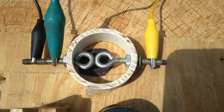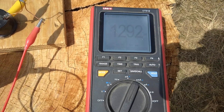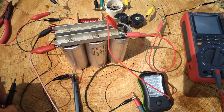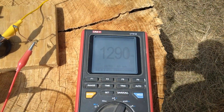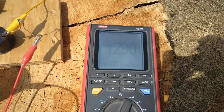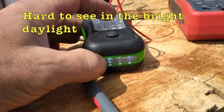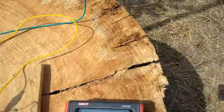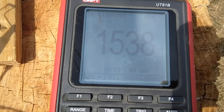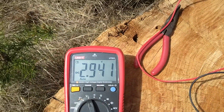It is sparking — I can hear it. We are getting about 12.9 milliamps on the 8 gauge wire, with voltage at about 2.9 volts — so 12.89 milliamps. Now going to the little wire, just the 30 gauge magnetic wire going down by itself through this little flashlight. With that one we are getting about 15.38 milliamps, with about the same voltage.